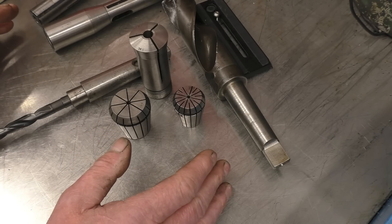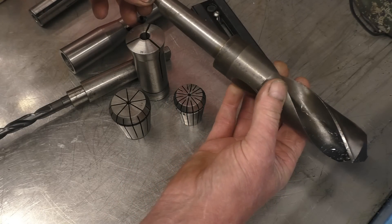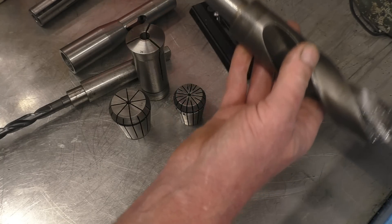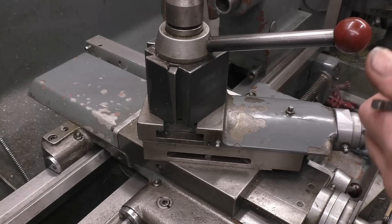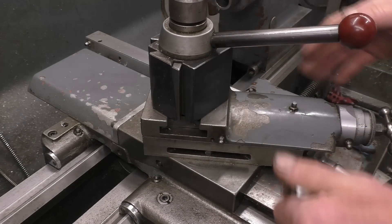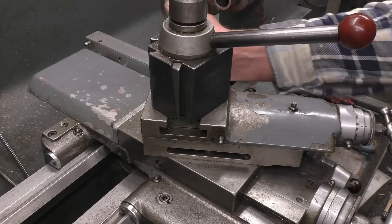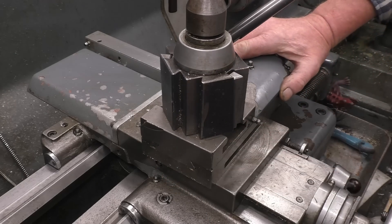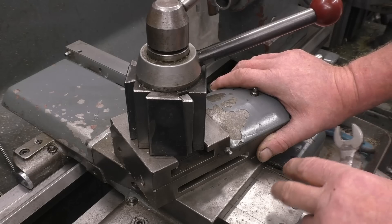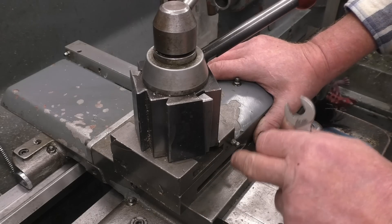We'll go to the lathe and I'll show you one way of machining the taper — I'm going to machine a Morse taper. That's a big drill that's had a Morse taper machined onto it, Morse taper 3. This is the easiest method: using the compound slide. The downside is you can only cut short tapers, but there's normally enough travel to cut a Morse taper. The compound slide is adjustable to any angle so you can cut internal as well as external tapers. The calibration gets you somewhere near — accurate enough for a 45-degree decorative taper, but not accurate enough for a Morse taper at 1.6 degrees.